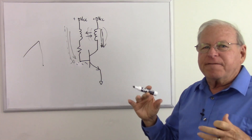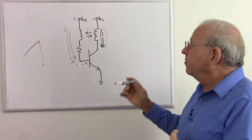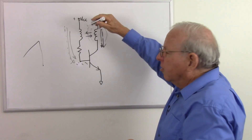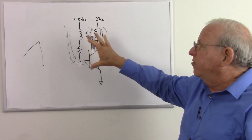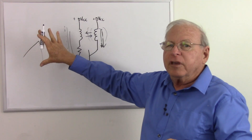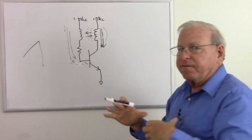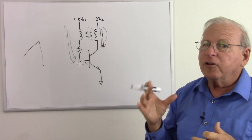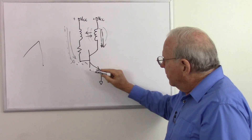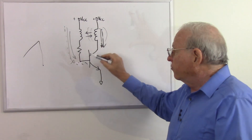I'm going to make a video showing how I did that, which will be available to my $2 and above patrons. I tinkered around with the parameters, making the components a little more realistic, adding some resistance and capacitance to the inductors and some resistance to the voltage source. That voltage from the collapsing magnetic fields became much less, but was still pretty high — sometimes in the hundreds of volts. So you may need to be sure to get a transistor that can handle high voltages for this to work.